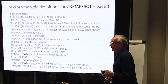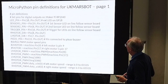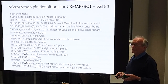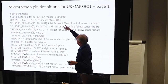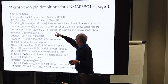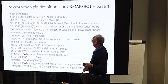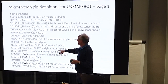If you're going to do a UK Mars bot, the first thing you need to do is sort out the pin definitions so they all match up with what we want them to be on the device. Here are a couple of pages that give you the basic definitions to set all this up so that everything talks to the right bits. We're setting up the LED pin, the couple of sensor pins, the trigger pin for the LEDs, your motor outputs, the piezo pin if you want to play a tune, and then your motor speed PWM pins and motor direction.